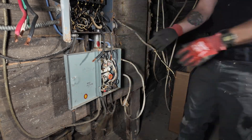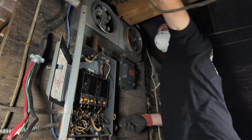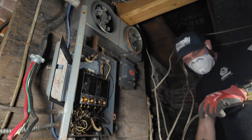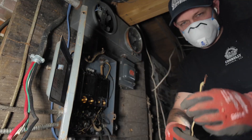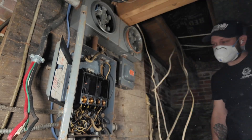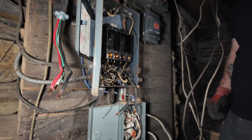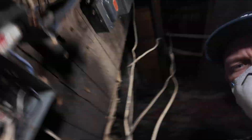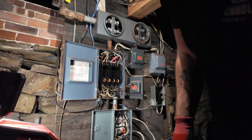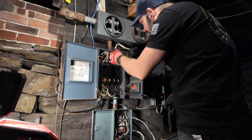Luckily the supply house was close enough and one of my guys delivered it over to me so I didn't have to leave, which came in super handy. There's that old Romex - it cracks in your hands, really old and really brittle. Part of the upgrading phases going down the line, all two-wire wiring is going to be slowly upgraded as well. It was just about being very delicate getting everything disconnected and put back together into the new panel, and as we go through the upgrade we're going to get rid of a lot of this old BX and old two-wire Romex.